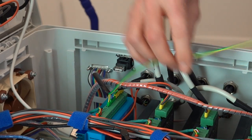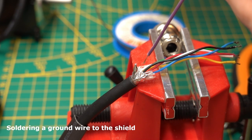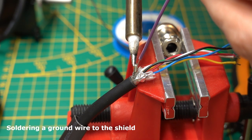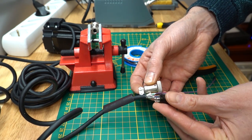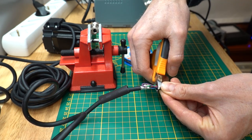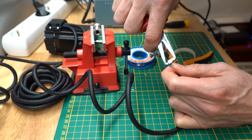Soldering GX16 connectors becomes increasingly more difficult the more pins it has. An alternative for an encoder cable would be an RJ45 connector. You do have to crimp the connector to the encoder wire yourself, and from experience I know that this also requires some practicing before you get it right. Make sure wires are not too long, since it's very difficult to deal with any excess wires due to the small connector housing. If you push the wires in too hard, they may short out or bend the pins.